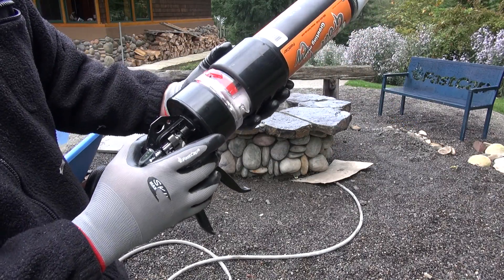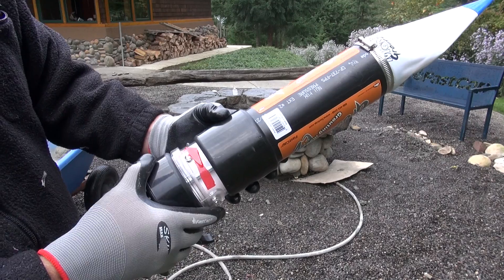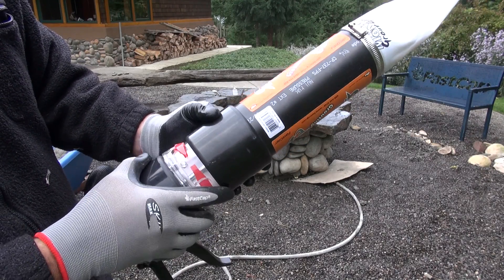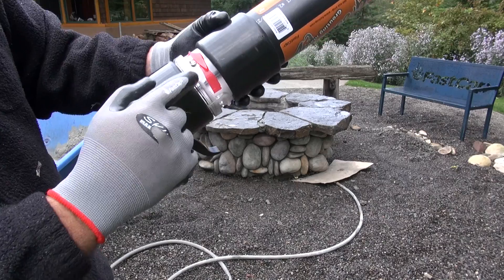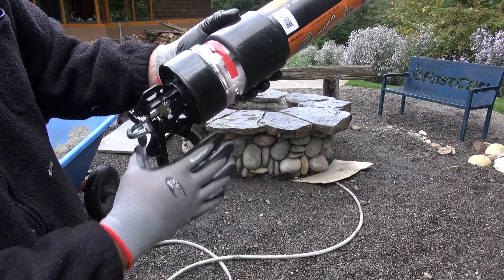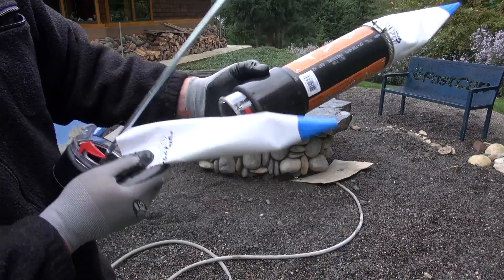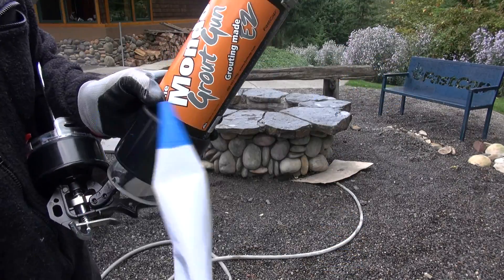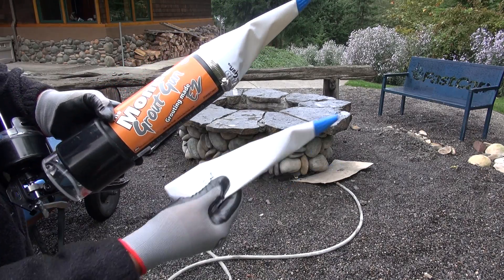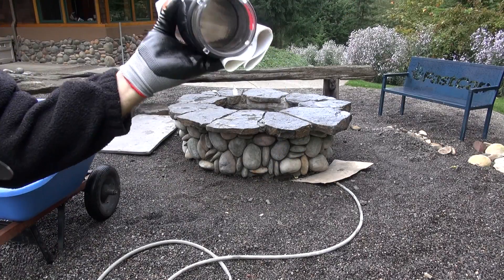Here's the unpacking of the Mondo grout gun. There's a little piece of red tape to hold the gun together in shipping, so we're going to break that tape. This joint is intentionally a little loose because if you get a bunch of mud in here it won't fit. When you pump it up it gets very tight. You pull it apart and there's an extra grout bag inside — very easy to replace. Simply take off this clamp right here, put the new grout bag on, and you're good to go.